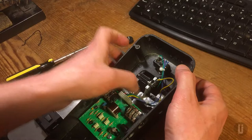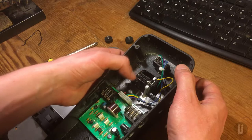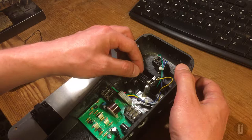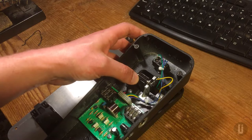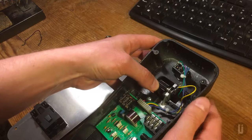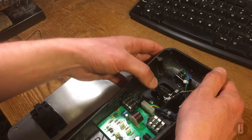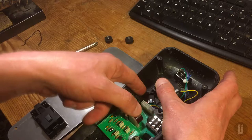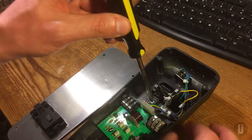I can move this thing back and get a little bit more movement out of the pot — it's actually quite a lot. I'm gonna dial it back a little bit so that it doesn't stop because of the pot, but because of the physical limit you get on the heel. We want the chassis to stop it and not the pot itself, because if the pot is stopping the motion every time you move it, you're gonna break the pot.